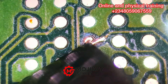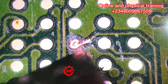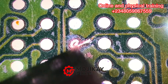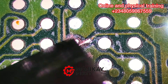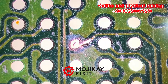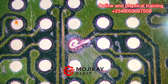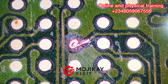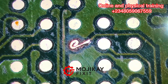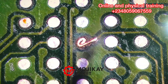After that we need to scratch off the UV oil because it's now in a solid state, so we need to scratch the surface off so that we can have a place where the ball can really connect with this repaired pad. Use a very sharp razor to scratch it out, and once that is done, clean. Cleaning is very very important — I clean thoroughly at each step. Be careful not to brush too hard.